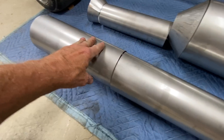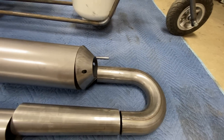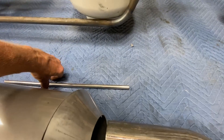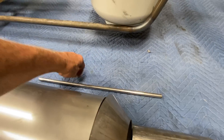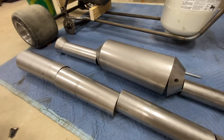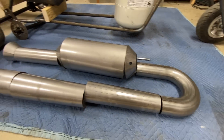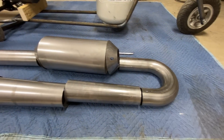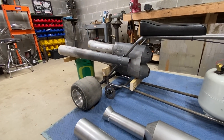You can see all the separate parts — all it is is just a bunch of hollow pipes, that's all this engine is. There's nothing inside it. It's just got a half-inch stainless fuel bar that'll go right through it, with some little holes in it, and the intake. That's all there is, and it makes up somewhere around 45 pounds of thrust per engine, sometimes up close to the hundred pound thrust range.